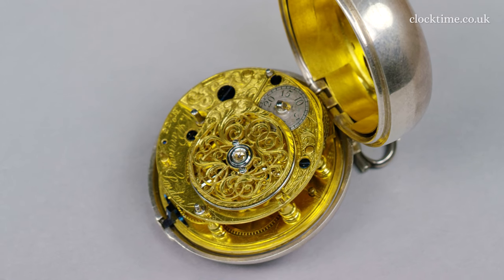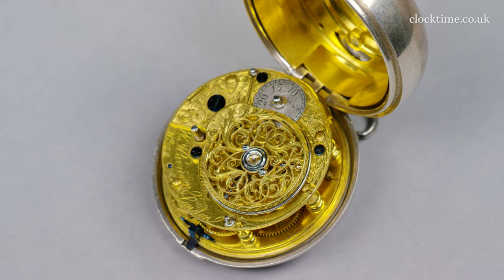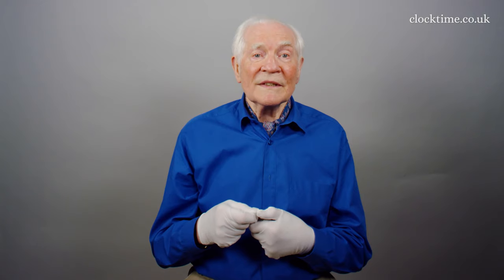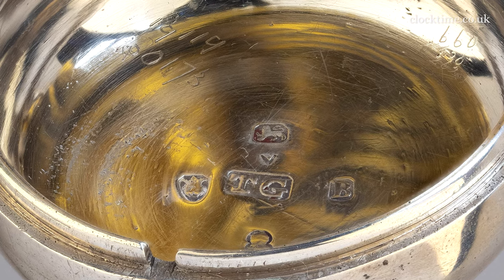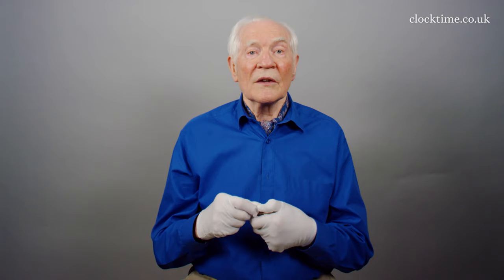For this watch, William created a miniature version of his father's prize-winning low-friction diamond pallet escapement design by altering the standard Verge balance wheel. While the diamond pallets on the H-4 chronometer watch were 4mm long by 1.5mm thick, those on Harrison's watch are comparatively minuscule. The watch's pair silver cases are stamped with the maker's mark TG, probably Thomas Gooch, and Hallmark London 1797.